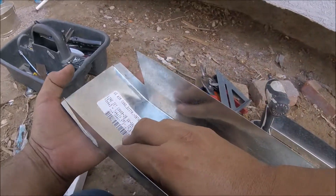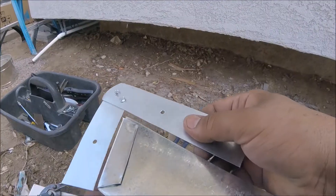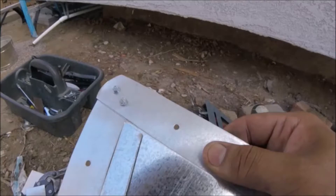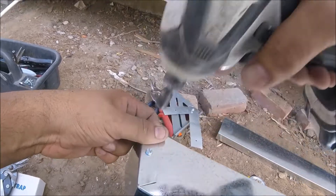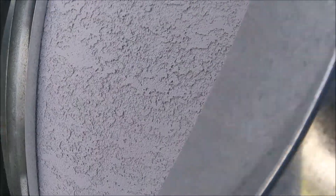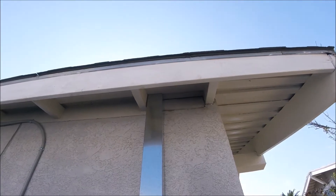You just cut the little corners and bend it in. This makes your installation look more professional. It's a small detail, but even without my angle finding tool you can still find ways of doing it. This is just one way I found that might be useful to somebody out in the field who just started installing and their line set cover comes up against the side of the roof — you don't want to waste too much time trying to find that angle.